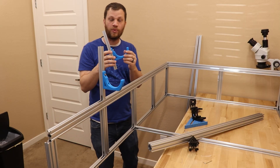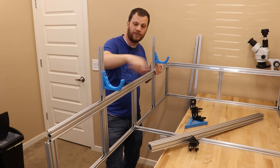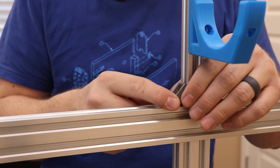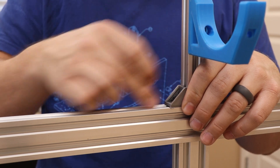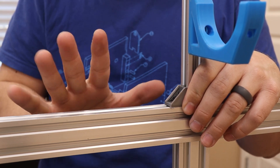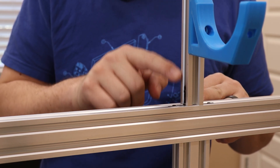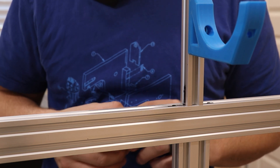I've printed a second tube mount that goes here, so the laser will sit in these little mounting brackets along the back of the machine. As you can see, if I had used the triangular gusset style bracket, it would have been in the way when I go to slide in the quarter-inch acrylic to enclose the machine. But by using the internal 90-degree style, I only have to notch out a little bit and slide a panel in — it will make everything look really nice.